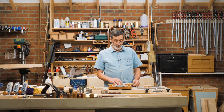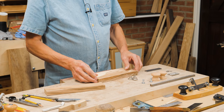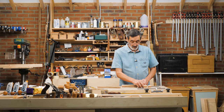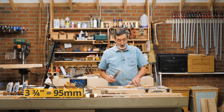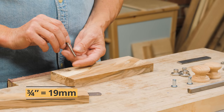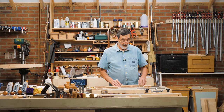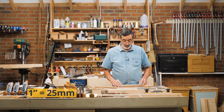I've got my base piece — that's this piece which is the sole — and we're going to put a hole in here. The overall length of my piece is nine and a half inches, three and three quarters wide, and one inch thick. You can go mildly under that one inch — I've gone down as much as three quarters of an inch — but you've got to remember that when you put your anchor bolts in for holding the handles and adjusters you're narrowing that margin of thread. I think the one inch is perfect.